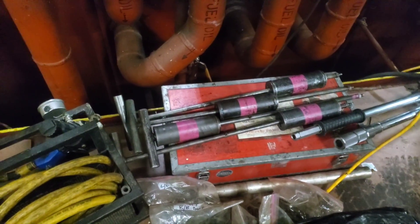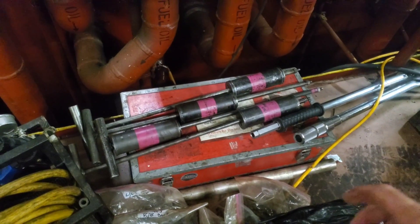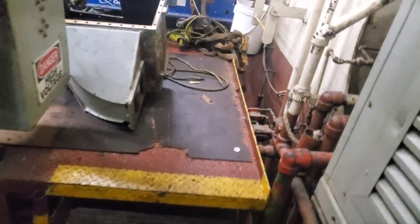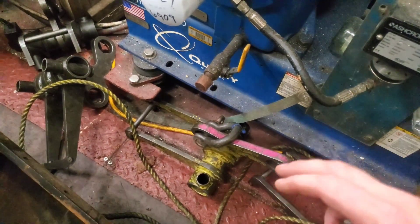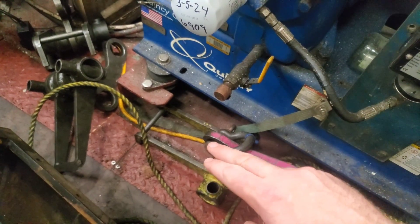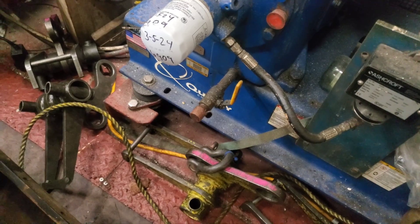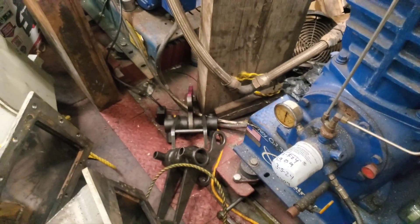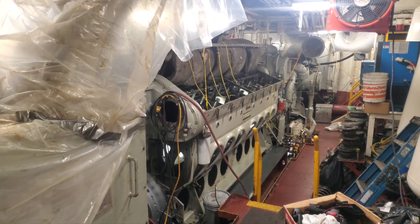Here are some of the lifting tools. This thing here — the T-handle at the top — has threads at the bottom, and there are female threads in the top of the piston, so they thread that into the top of the piston through a lifting hook, which is right here. You have your crane or chain fall attached to this, the head is attached to that — still bolted to the liner — and then your piston tool goes to the center. That's how you lift the entire power pack: piston, rod, liner, and head all out at once. Really simple tools that make these things really easy to work on. Thanks again for watching, guys — I hope you enjoyed. If you want to see more of these, leave a comment. I appreciate it — I'll see you on the next one, bye.